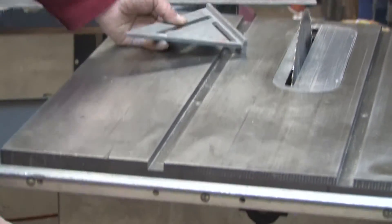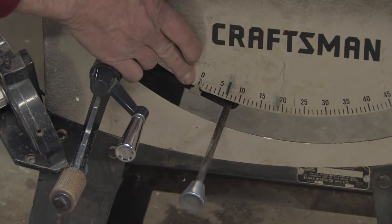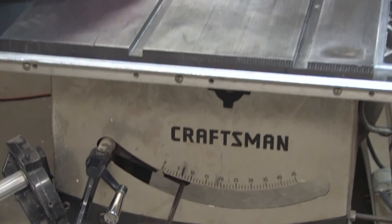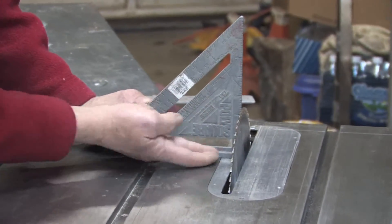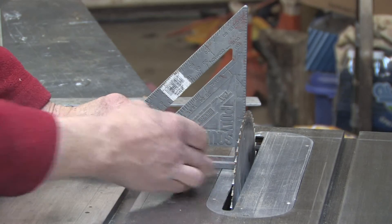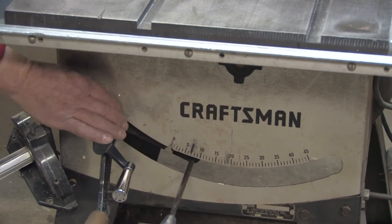Another thing you can do: most of the pointing devices used for the angle — the actual arrow indicator — is calibratable itself. You'll want to check your 90 degrees by using the corner square, holding it flush on the base, checking in between the carbide teeth, and making sure that that's a perfect 90 degree angle. If that's off, adjust the handle until it reaches 90 degrees, and then change the calibration on your pointer, which is done by loosening the set screw on the bottom and moving it so it reads absolute zero.